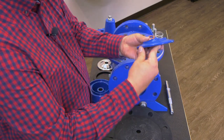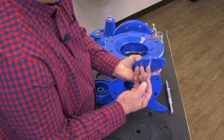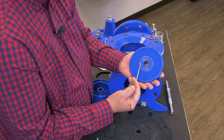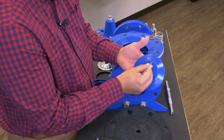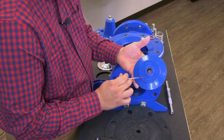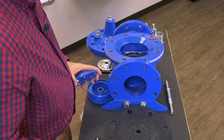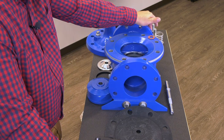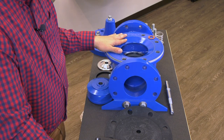Let's talk about our diaphragm washer. These edges are our diaphragm support area — make sure those are clear from any debris. Not much cleanup on the flat surface; there are those serrations on the top side. Make sure you clean up any larger deposits on top. This machined flat is where those mechanical stops make contact — make sure these are clear from any debris. Being that this valve is epoxy coated, those that are epoxy coated will take less time to rebuild, which is why the epoxy coated parts come with the repair kit.